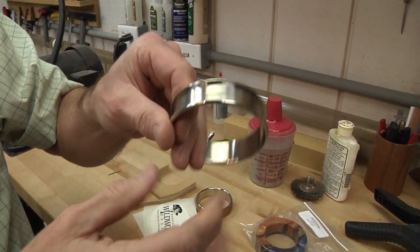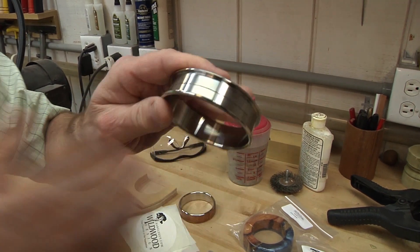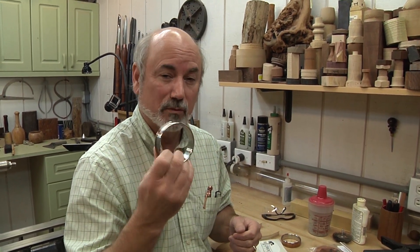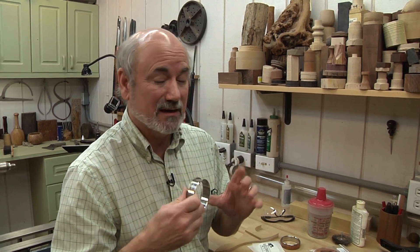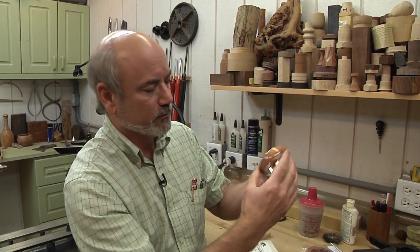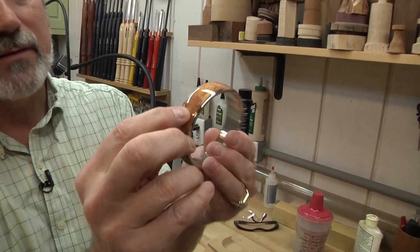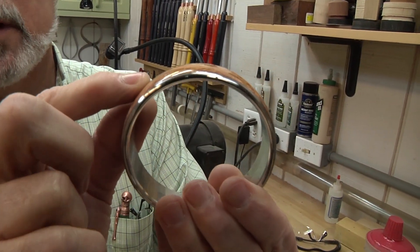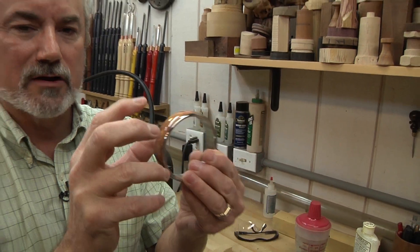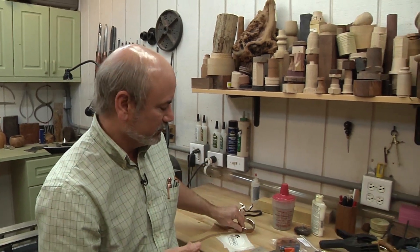You're going to turn the piece of wood that goes in there, and you can use your own wood. But as he said, it needs to be oven dried - not kiln dried, not room dried, not dry dried, but oven dried. Because if the wood will move when you finish it, if you have any moisture in your wood, it's going to crack because you're turning a piece of wood that is so daggum thin. That might be an eighth of an inch thick right there - almost like a veneer. If it starts to dry and shrink, it'll pop really fast.